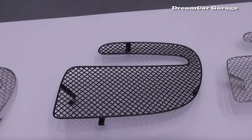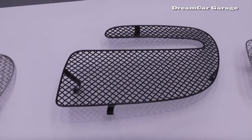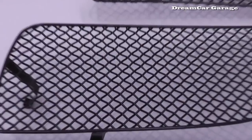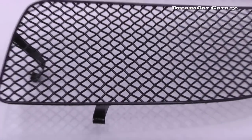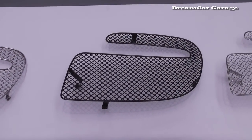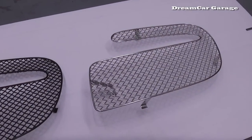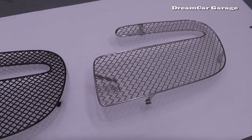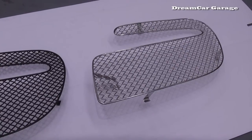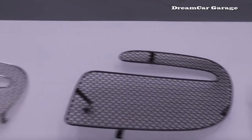No, it's not. If you compare it with powder coating, powder coating will flake off. Nylon coating will shrink back onto the metal. It's a nylon polymer coating, as used by Jaguar, Bentley, Aston Martin. And this final one is an electropolish process, where we're actually polishing the base material. So you're not adding a covering that can scratch off? Correct. There's no flaking on either of the finishes, black or polished.